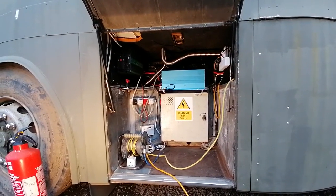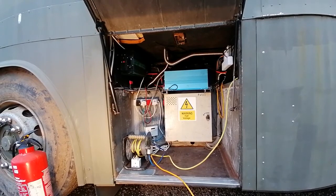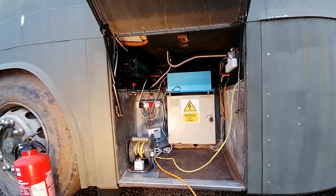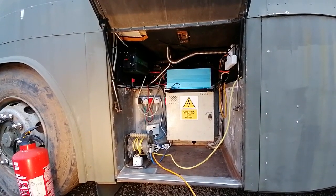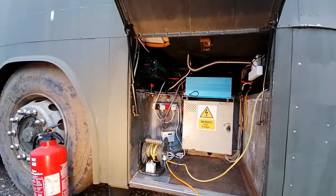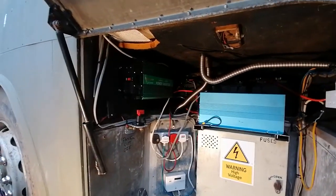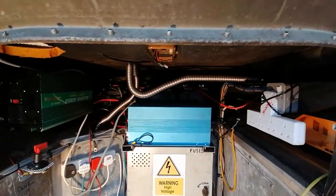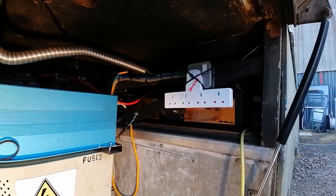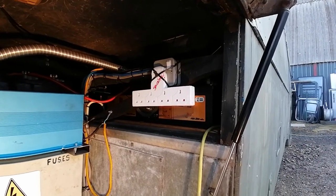Compartment number two — we have all the electrics for the solar panels on the roof. At the moment I have a thousand watts of solar panels. In the summer it does great; winter not so good. I'm very lucky where I am — the owner of the land allows me to plug into the mains for now. In the summer I'm going to double up to 2,000 watts of solar panels. We've got two inverters — the main one is the blue one and the green one is a backup. Down the back you can see three large leisure batteries, and there are also another two on this side. The batteries aren't all the same — I got those two off Facebook Marketplace.